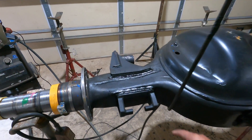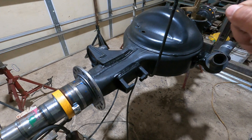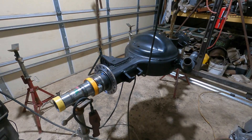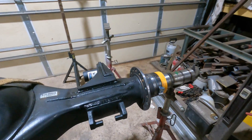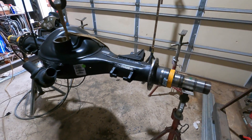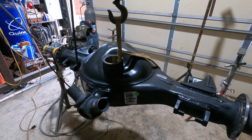It turned out really well. I really like the way it looks with paint on it especially — looks really neat. I'm not used to not being able to see the cooling edge of the puddle like on the 7018. You can kind of direct the weld with dual shield, but I'm having difficulty seeing it because the flux stays hot for so long trailing behind it. Something I have to get used to. Again, a big old thanks to Eric over there at Four Corners Welding Supply in Gallup. Go give him some support — that was really nice of him to send a roll of wire. I'll be using that wire here in the shop machine, and of course a standard solid wire for other things. Just thought I'd let you know we are done — it's off to the customer. We'll catch you guys on the next one.